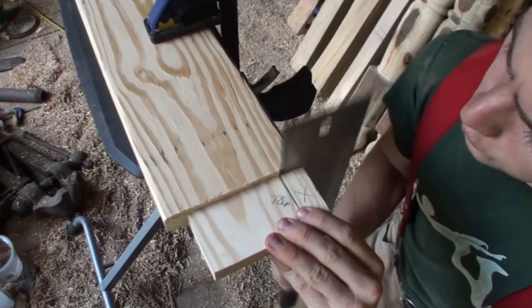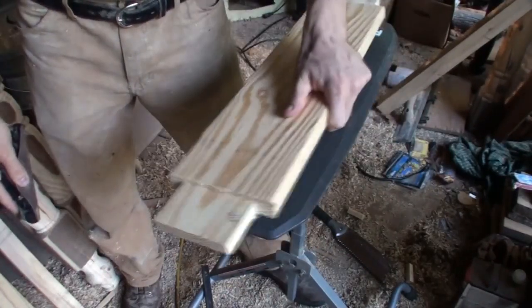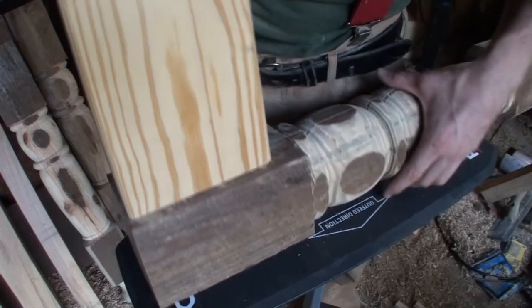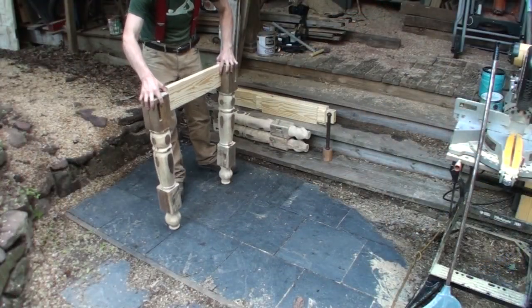Where I can't cut off the excess because of the capacity of my band saw, I just do that with a Japanese-style saw. Then I'm chamfering the edges of the ends of the tenons so they don't scrape the glue off the walls of the mortises as I put this together.